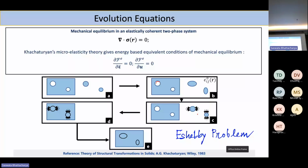However, there is one interesting challenge. Please understand, this is where the homogenization problem and periodic boundary conditions become important. Think of what we generally take when we do phase field modeling. I do not take the entire plane and solve it. It's not like a macro body. We are looking at a microstructure and solving this. This microstructure is like a control volume, you know the control volume concept, right? In this case it is called a representative volume. This representative volume represents the whole body. You can also call it a statistical volume. You take this and assume that it is repeated all over space.